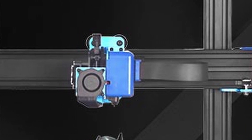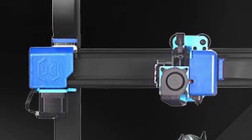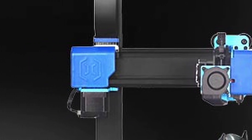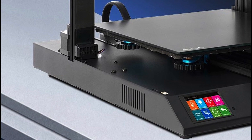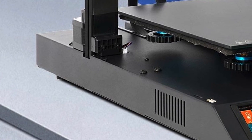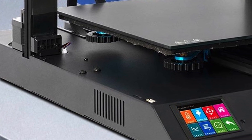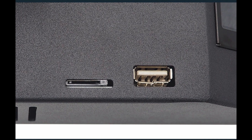I think they used the 2060 because of the ribbon cable underneath the carriage. We also see blue injection-molded plastic covers. On the left side there is a stepper motor for moving the carriage over the X-axis. The base looks very similar to the X1. On the left side we have the color LCD touchscreen, and above the TFT screen there is a USB connector, which was also on the X1. On the right side there is a USB Type-B connector for connecting to a laptop, PC, or OctoPrint.